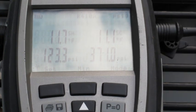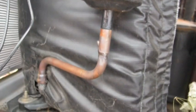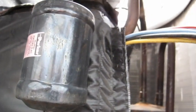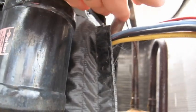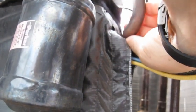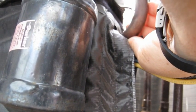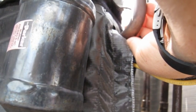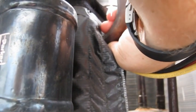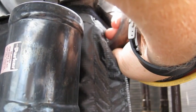There are a few ways you can check quickly to see if it is the valves. This is my compressor here — it is a two-stage reciprocating compressor. Over here, this is my suction line going into the compressor. If you put your hand on that right next to the compressor and you shut the unit off, if you feel any heat after the unit shuts off, it should be cold. If you feel any heat coming there, that's telling you that hot gas is bypassing the valve and feeding back into the suction line. It's not the most accurate test, but it is a test you can do. Feel for any hot gas — that's one way to tell if you've got bad valves.